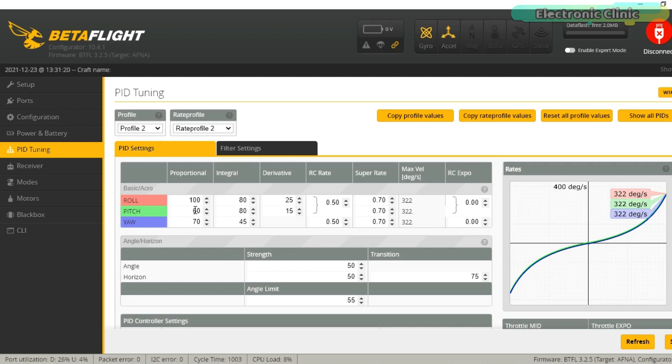It's like a hit-and-trial method. It may take a lot of time to find the perfect PID values — this is the only way to fully understand how these different values affect the overall performance of the drone. It's simple: if you have oscillations on the pitch axis, change the value next to pitch in the proportional column, and if you have oscillations on the roll axis, change the value next to roll. After you have fixed most of the oscillations you will feel it when you fly the drone.